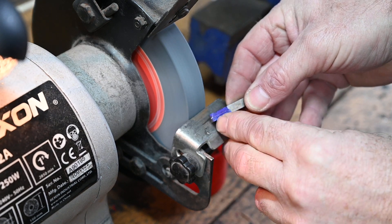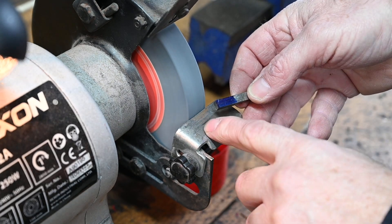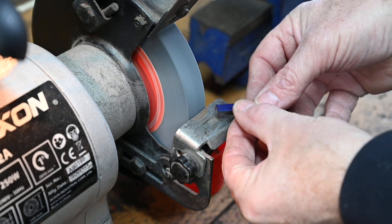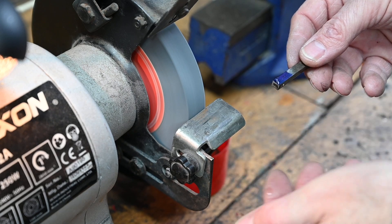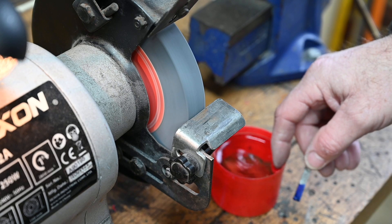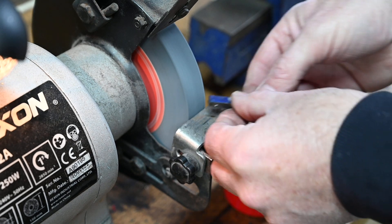This little corner here is what I've got to grind out of the tool. This little fence on the grinder is actually set to about 12 degrees. I've got a little pot of water here to cool the tool — when the tool gets too hot to touch I just dunk it.